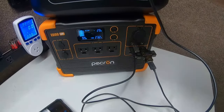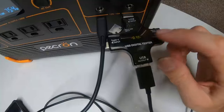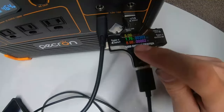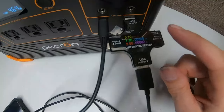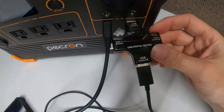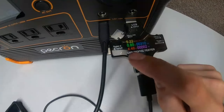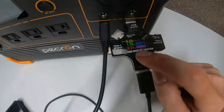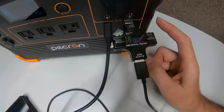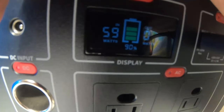It's about 5 to 9 watts — I can't see well enough to read the exact number. Notice it dropped back down again. Let me go to the main screen on this little meter. We're back to 9 watts at 5 volts at 1.7 amps — that's normal. Now we'll see what it does in live time when I plug this big one in. It reset! It's coming out at 4.5 watts, then back up to 9. When you unplug this, watch it spike — see how that spiked in real time.